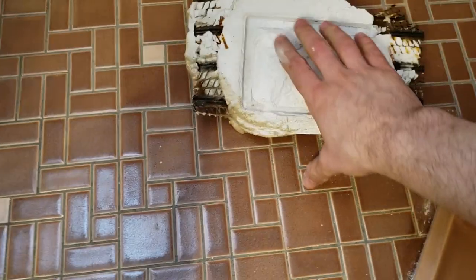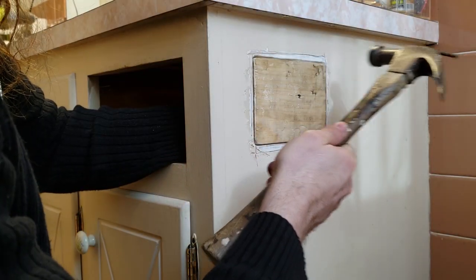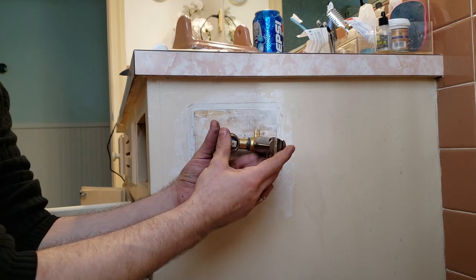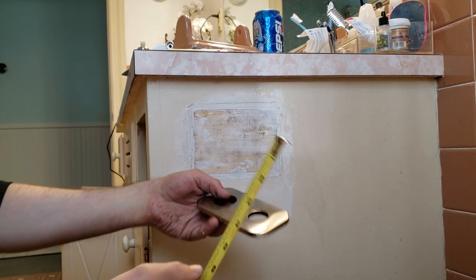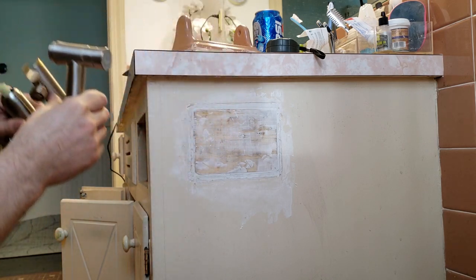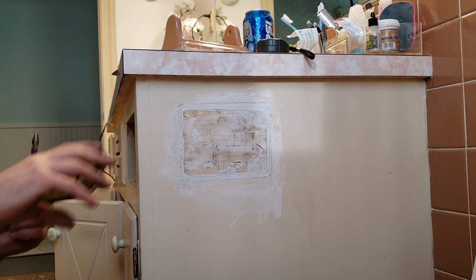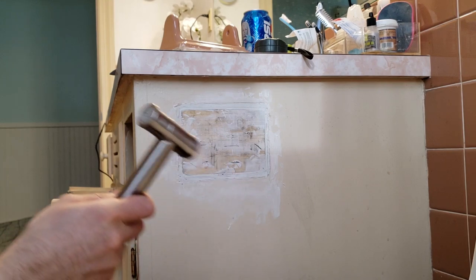Now that is seriously bizarre — just look at this contraption they created just to mount it here. But anyways, I've crafted a little plate. We're looking good — easily the finest craftsmanship this side of the Mississippi. We're going to be drawing where to drill the holes. I've got two different size holes to drill here. I'm going to use this cover plate as a template. Looks like we've got a one-inch hole and one one-and-a-quarter-inch hole. Be careful for purely aesthetic reasons that your handle doesn't stick out above the counter. Handle on the right, therefore the smaller hole goes on the right-hand side.